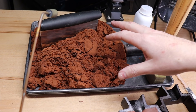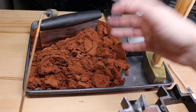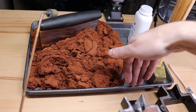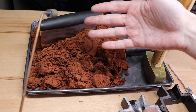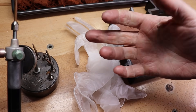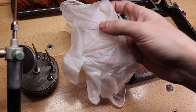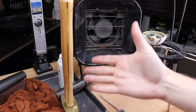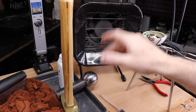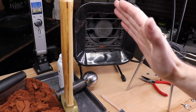Cookie trays will also keep everything in one area, so if you pour metal and it gets out, or your mold fails and it all pours out, it'll stay in the cookie sheet. It's even better if you put something underneath it like a fire brick, just in case — it doesn't burn your wooden table. Whenever I'm working with this stuff, I also use gloves because it gets stuck to my hands and it doesn't like to stick to vinyl gloves that much. One other thing you're going to need is ventilation or do this outside. I have an inline fan that just sucks everything out of the room.